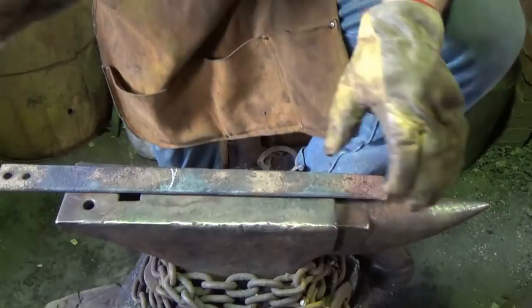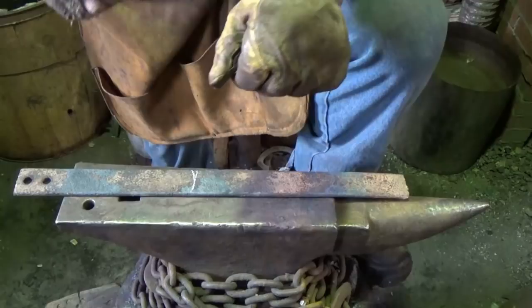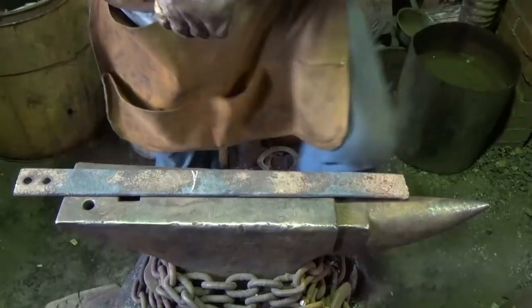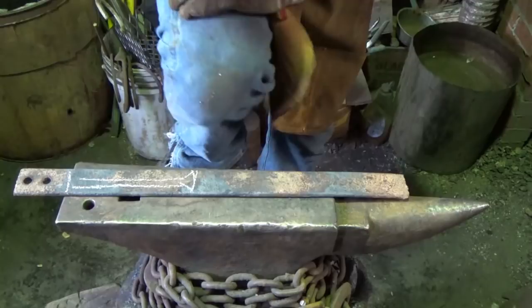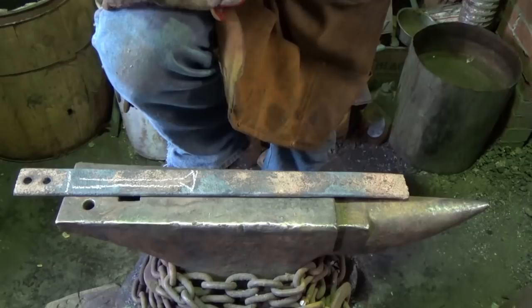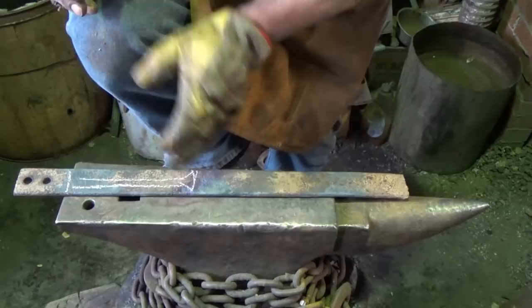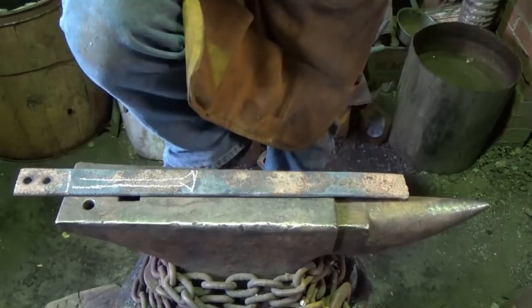What I'm going to do is the perpendicular eye — just for the sake of exercise. What that's going to require me to do is take this from this point here. I could just twist it and then put the eye on, but I don't want to do that. I don't want to put that twist in there — that's the easy way out. We're trying to learn as much as we can as we do these. So I'm going to squish it down and then draw it out in the opposite direction. That way you're going to get that perpendicular handle without a twist and hopefully without a stress point.